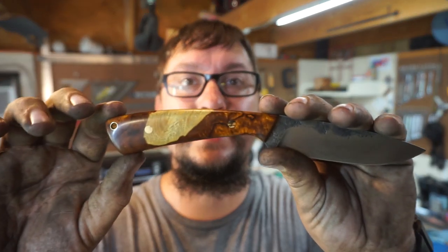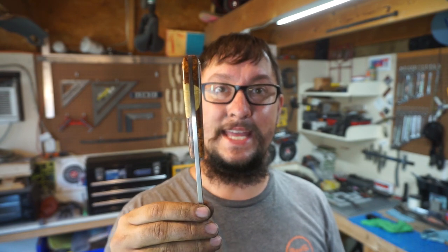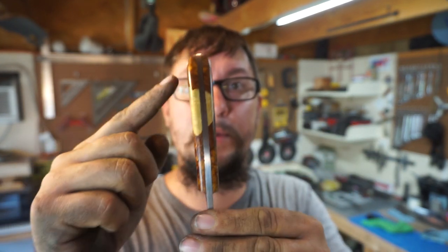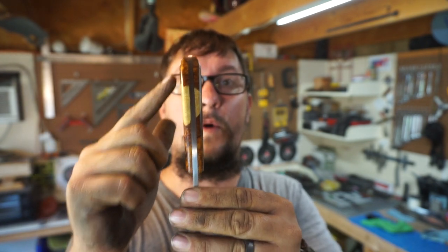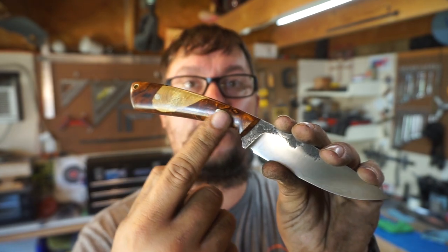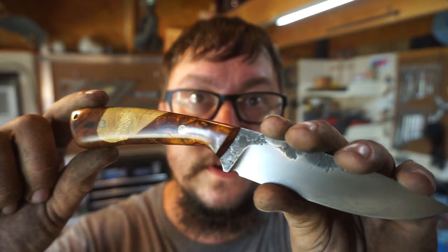And what I want to talk about for a second is the contouring, like what we were really trying to focus on. So this doesn't have all of the crazy contouring that you can put on a handle. I've done the Coke bottle handle shape, and plenty of other crazy contoured ones. What I did to this to make it index correctly was just how I tapered in from wide to thinner. Not a super crazy amount of taper, just enough from wide to thinner, and then right through here, making that finger well right there, nice and contoured.